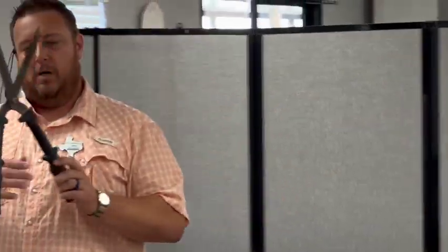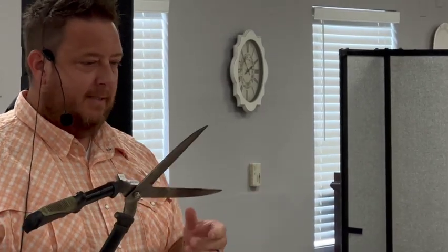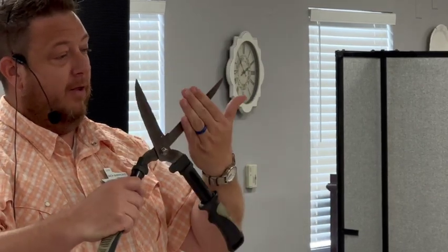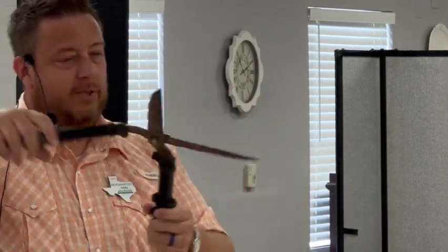The same is true for clippers, or what do we call these — hedge trimmers? This one is actually serrated. Different blades have different textures on them. I try to stay away from serrated stuff because it's a mess to sharpen. The average person cannot sharpen serrated things. You can remove the serrations on a grinding wheel if you want, but it's the same geometry — flatten the back, angle on the front — for your scissors too: flat back, angle front.